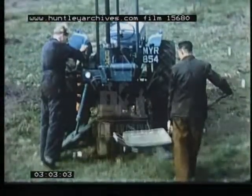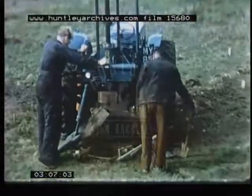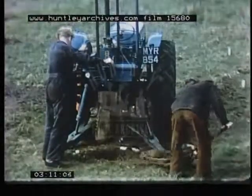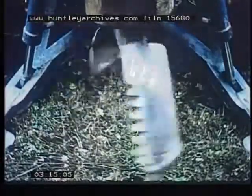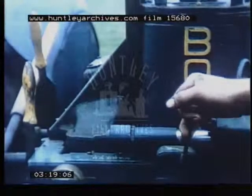The withdrawal of the auger is power operated. The blades are opened and the excavated soil is taken on the special shovel which effectively covers the hole. This is how the auger blades open under the ground when they are making the under reaming cut, and here is the hydraulic gear which operates the blades.